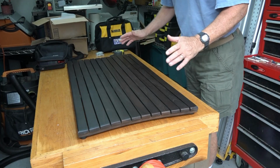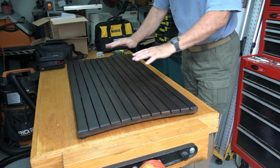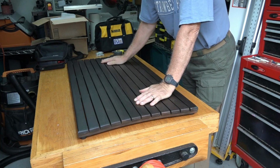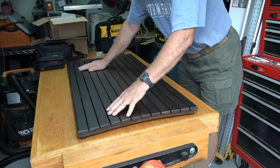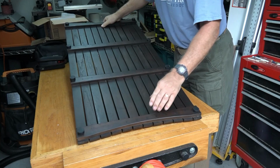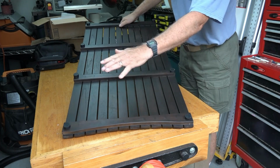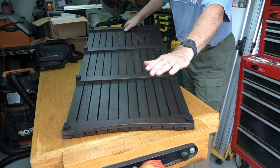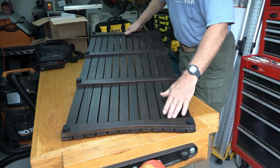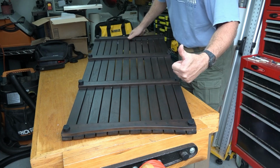Okay, to really finish off this tub repair, I want to support the walking in the tub more evenly. So I bought this solid teak floor mat that goes in a tub, and you can see nice long slats. It's 20 by 40, which fits my tub perfect. It was designed to rest on these little rubber pads. That's the first thing I want to change. I want to support it all the way across, so when you step on it, your weight gets all over the bottom of the tub. But additionally, as you know, my tub is stepped, so I need to add a couple of supports to make it come out even. So let's get started on that.